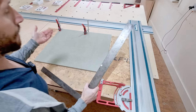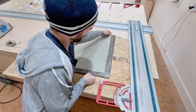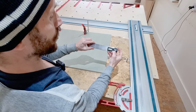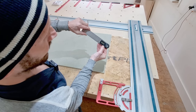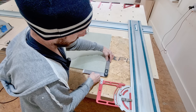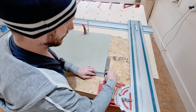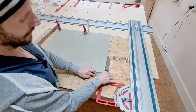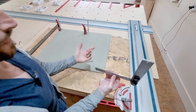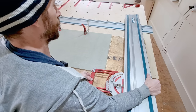So what we're going to do is use our square — my trusty reference square which I use for my staircases — and I've also got a Trend digital guide. Let's start with a nice square board. I'm going to test it with my roofing square — perfectly square, absolutely perfect. Let's also check this digital Trend version. Let's turn it on, zero it. We've got 89.9, which isn't too bad — it's pretty much spot on square. Now we know we've got this calibrated and we know this is square.